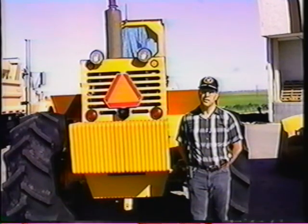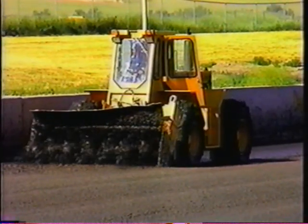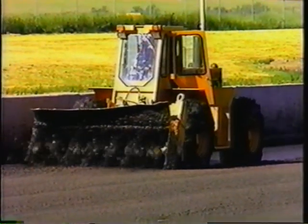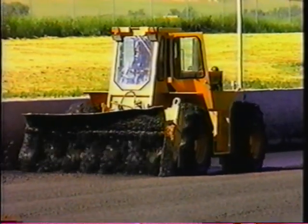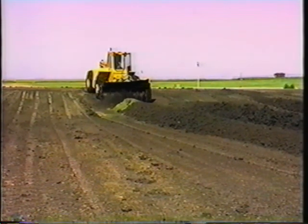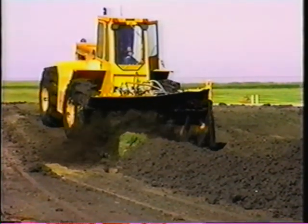I've been working with them for 14 years and have been involved in the biosolids program for three years. The process here is air dried. We turn our biosolids in windrows out into the drying bed, drying them anywhere from 60 to 70 percent, then haul and store them. We continue turning the biosolids to 65 to 85 percent and then land apply them on pasture land.